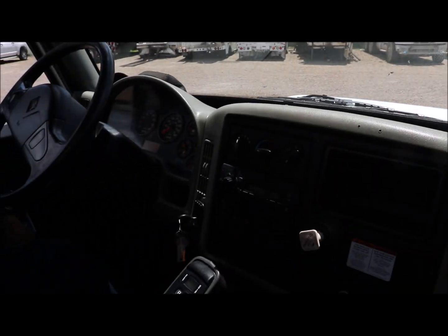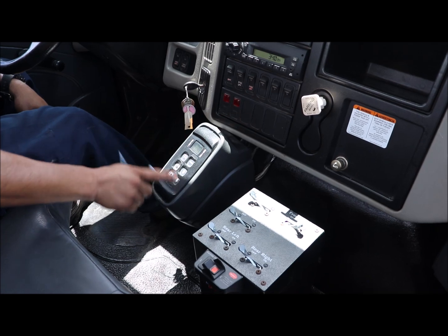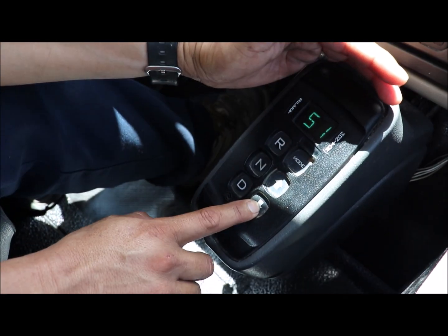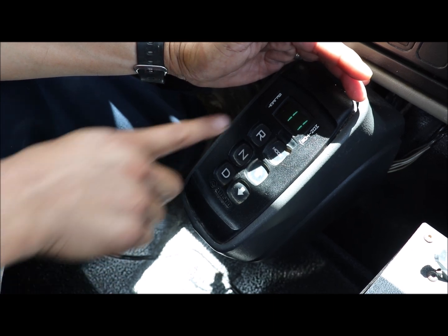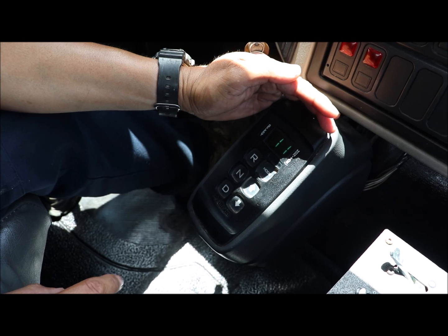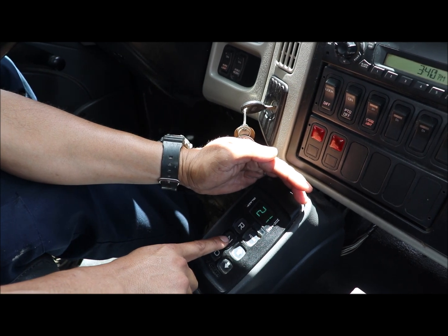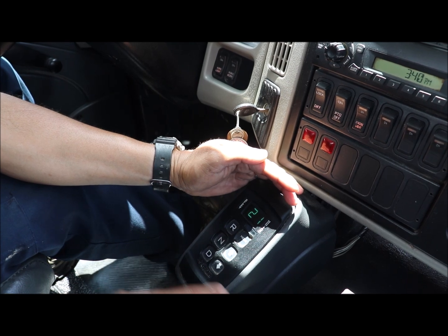Okay, if we desire to move while the PTO is running, or do the mobile function, we're simply going to put it in drive. You guys can see here, we're going to lower down to first gear. That's what we're going to do in the video next. The reason why we chose gear one is to maximize the output on the water pump and the spray system. You can always go to number two if you decide to go a little bit faster. Anything above 2nd is going to be just too much speed for the function of the system. So we'll demonstrate that on the next video.